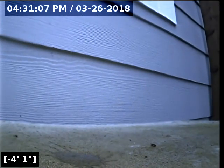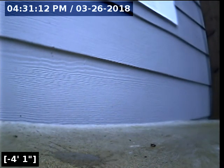There are no offset joints, and no bellies in the line retaining water. The drain water is flowing to the main without obstruction. This is a passed sewer line camera inspection for this property. I will have a written report along with this video upload for you and your realtor to view. Thank you for choosing Lantern Inspections.